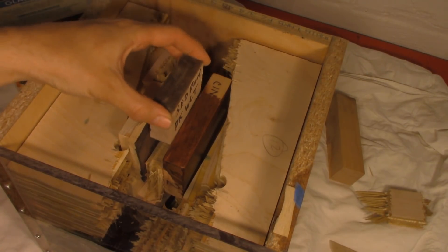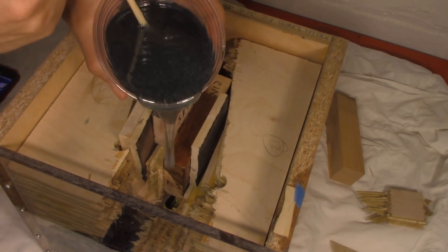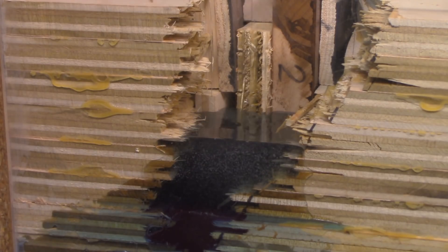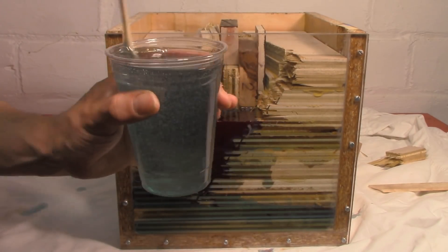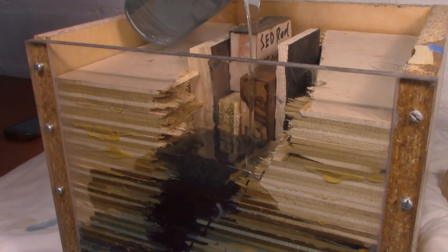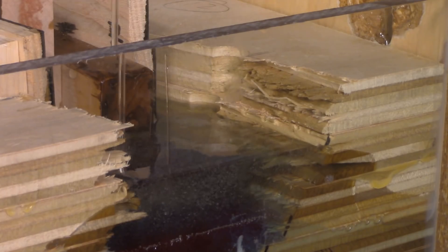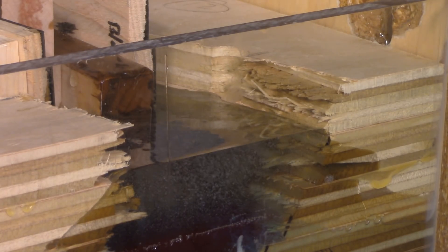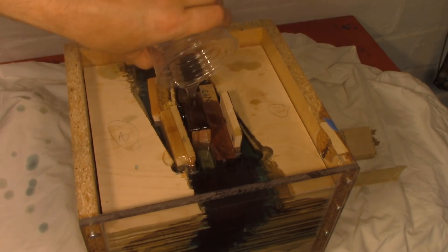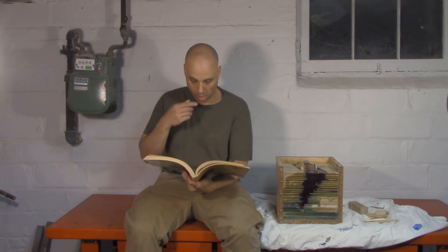Now I want to take up some space so I can save some resin. I'm going to turn away all the middle on the lathe anyway, so I just jammed some scraps of wood in there. Here's my next resin pour and I'm probably down to 10 drops, then this one is five drops of color — and you can see I'm getting this nice turquoise color, it's really changing beautifully as I go further up. This is my last pour right here and I'm down to three drops of color, so it's almost totally clear. It took three quarts of resin and now it's 72 hours to cure, so there's a lot of waiting.